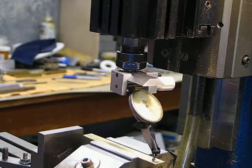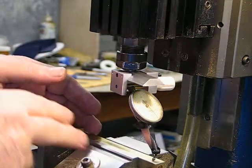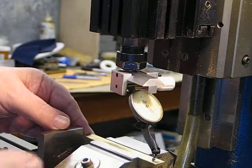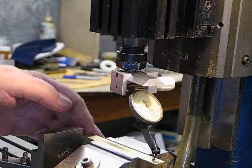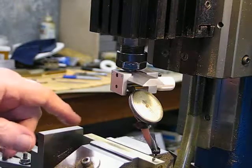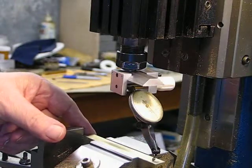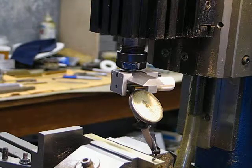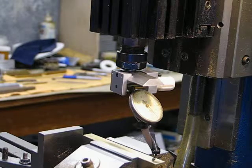You might use a tooling hole as your datum, or you might use the edge as a datum. Usually you used a corner on the X and Y axis and worked everything out from there. Your holes — you listed the dimensions in a form, then you moved everything in one direction, which eliminated any backlash, and you worked from the bottom left corner or the top left corner. It was a learning experience, something you were taught as an apprentice.